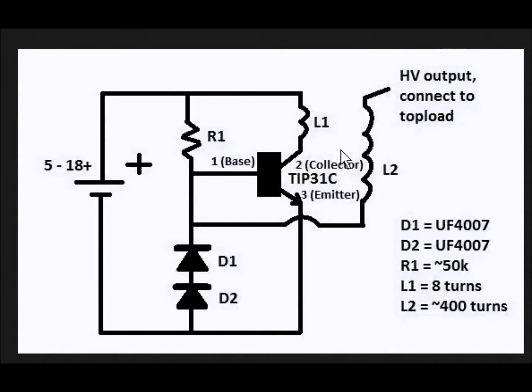There are a few things I deviated from. I did not use the recommended 18 volts DC — I used 32 volts DC, because I had a heatsink on my transistor and a fan to cool it. Also for L1, I did not use the eight-turn recommendation — I used five turns to get a higher gain. The way transformers work, turns on the primary versus turns on the secondary determine your gain: five turns primary and 500 turns secondary gives a gain of 100.